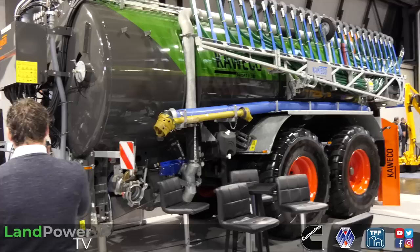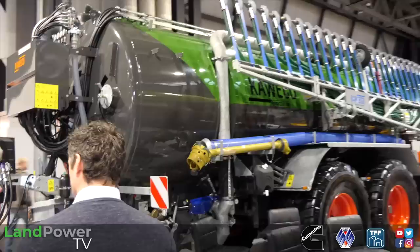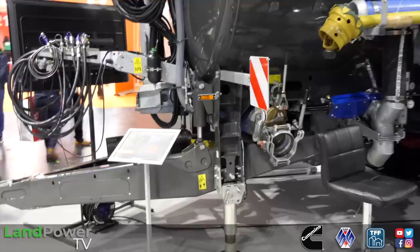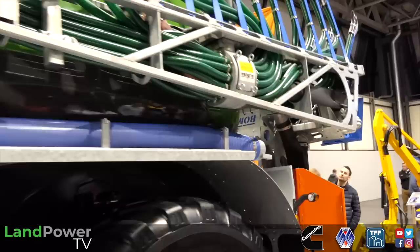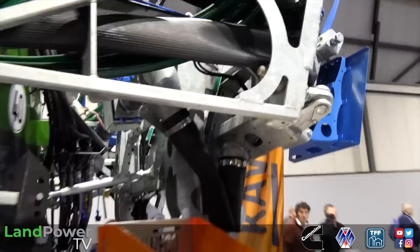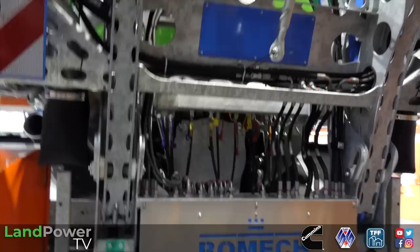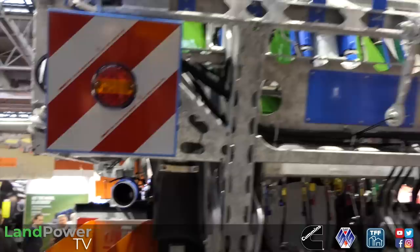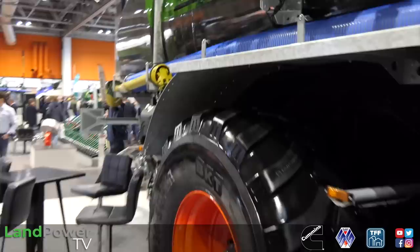What sort of options are we looking at - additional axles, different booms? We're talking about a cutting system on the side to cut everything in the slurry, suction arm, different connections on the side, drawbar suspensions. About 60% of the tanker is standard and the rest are all options the customer can specify. The Pro-V2 tanker comes from 8 cubic metres single axle up by 2,000 litres to 30,000 litre 3-axle - that's the biggest in the Pro-V2. The Pro-V3 goes up to 38,000 litres. That's a massive machine.